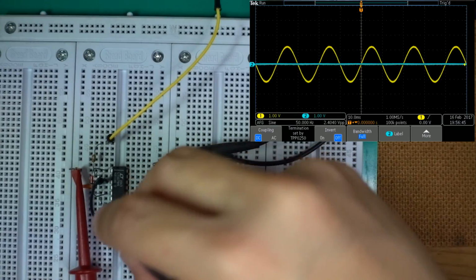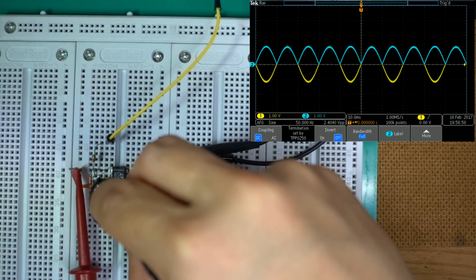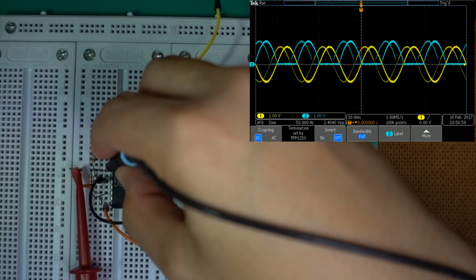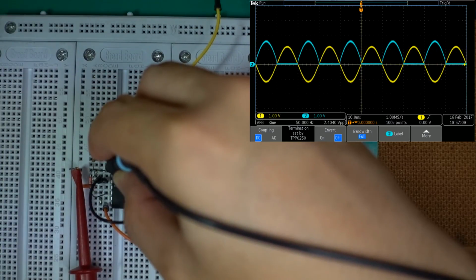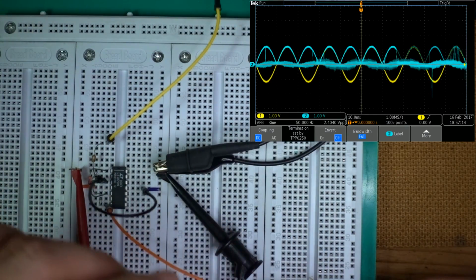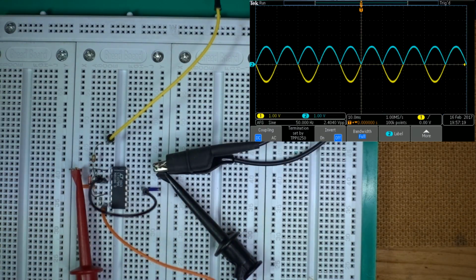If we trace the output of this, you can see basically what it does is mix that up. I can't see just half of it, unfortunately. Maybe I can get half of it just at the output here. Yep, there you go. So that's just the first op amp at work. It flips it, and on the positive going cycle, it blocks it. But then it gets mixed back over here, and what you see then is this amazing output, which combines to this. I actually think it's brilliant.